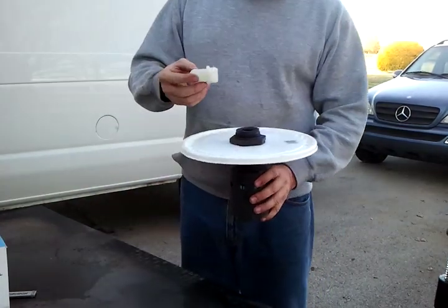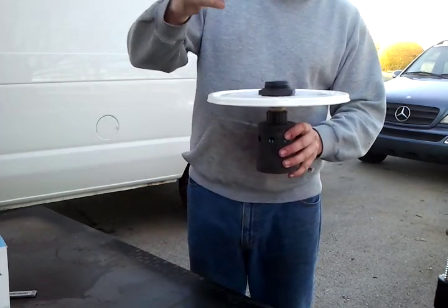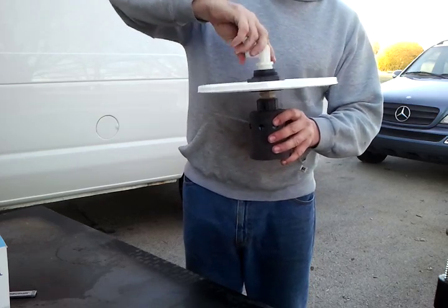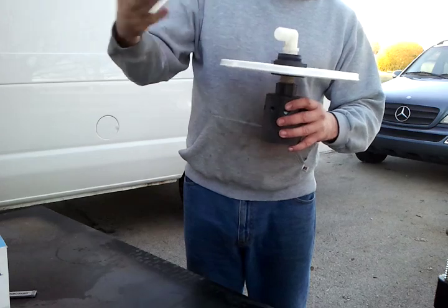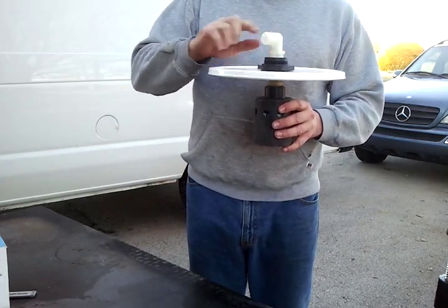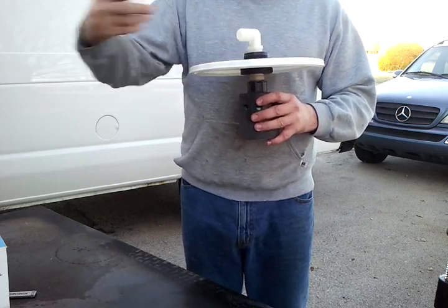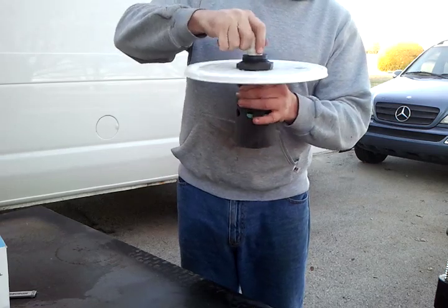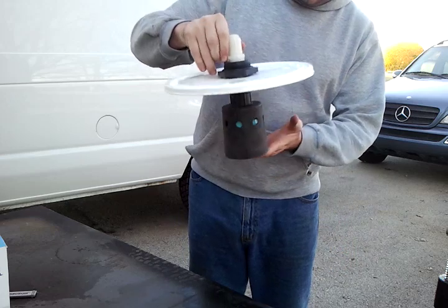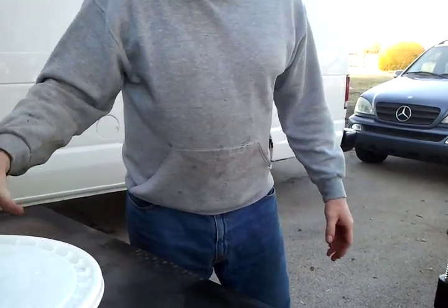On the top connection, I like using an elbow. Get your one-inch elbow, clamp your hose on, and you're good to go. Because I actually put a filter on this setup, this elbow is threaded on both sides so I can run it, put the filter on there as well, and then the nipple. But this gives you the gist of how to install that Hudson float valve.